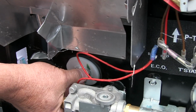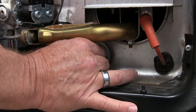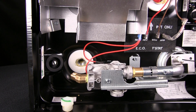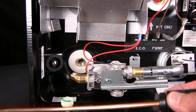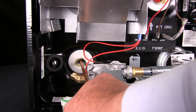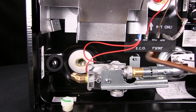Here's the drain plug on this Atwood water heater. On a Suburban, the drain plug incorporates its requisite anode rod, but on the Atwood, it's simply a plastic plug. By the way, there's no need for an anode rod in any Atwood water heater ever. Periodically drain and flush the water heater, especially if you experience an odor issue in the hot water. A hose attachment like this can be inserted into the drain plug opening to agitate and rinse the mineral deposits at the bottom of the tank.